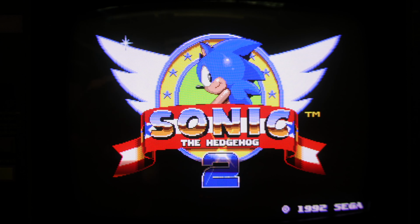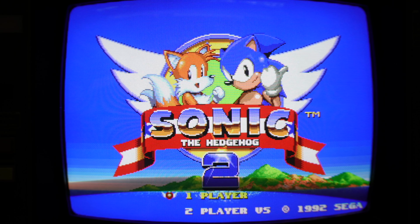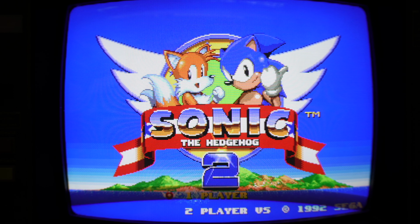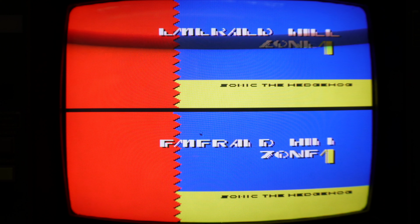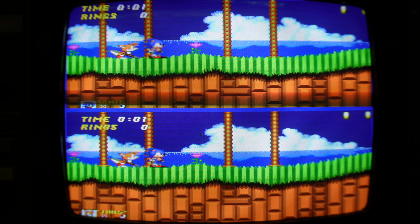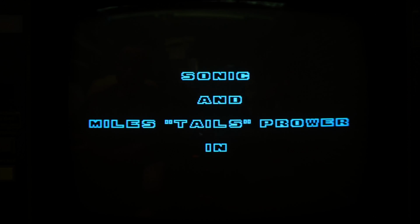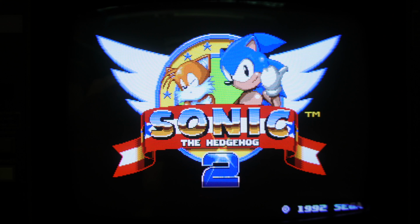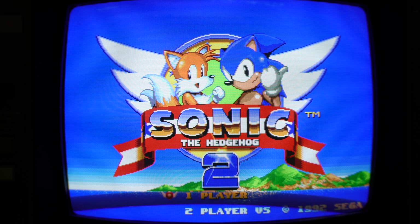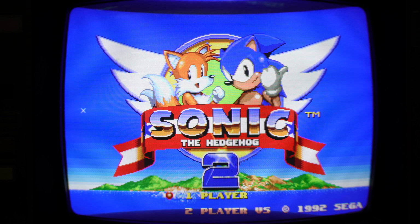Finally, back on the Megadrive again in good old RGB. Good RGB from the Megadrive, although this Megadrive hasn't had any RGB bypassing and it has some jail bars in it. Still, it gives a pretty good picture as is. All in all, this is a very good alternative to Sony's Aperture Grill Trinitron tubes. If you prefer the shadow mask style, then certainly go for the Ikegami here.